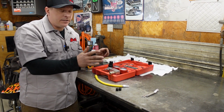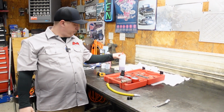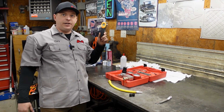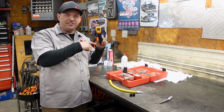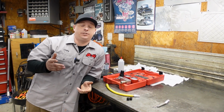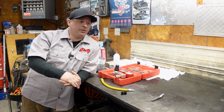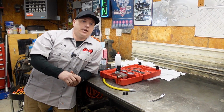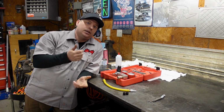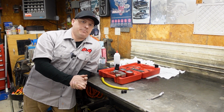And then at the first fire, what you're gonna need is a little bottle of gasoline. This is a good old 110 from Chris's Nova, and a degree temperature thermometer. This thing, you know what I'm talking about, this little guy. Because after it's running, you want to check your exhaust headers. In the instructions Spud gave me, he wants to see about 450 degrees at the header. So that's what we're going to shoot for. Let me get this set up over here, and I'll show you how to adjust those 2 items, and then we'll get this thing fired up.